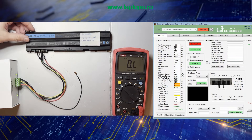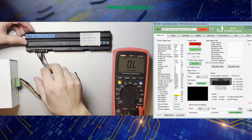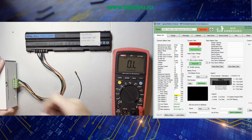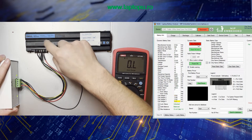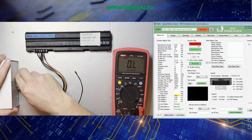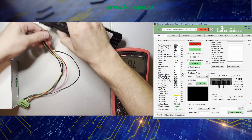In the software for Dell batteries, it is usually required to start reading again because several special commands are sent at the beginning. Right now we have a correct connection and the output LED is on, so the battery is unlocked. The chip enables the power to the output connector, so everything is fine from the connection point of view. I'm going to take another battery.